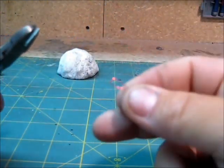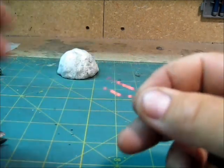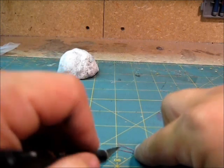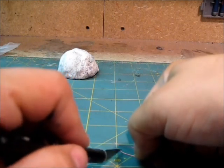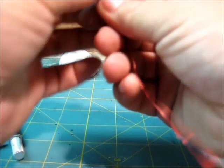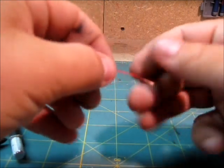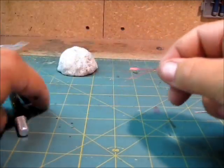On the other end, snip off the tip where it loops around. Now, this enamel-coated wire is actually coated with enamel, so take your X-Acto knife and scrape off the enamel — make sure you get every single side. You need to be showing copper all the way across, because if there's enamel left the power won't conduct through it. Also tie a knot on this end, and scrape the other end the same way.